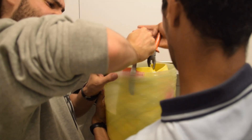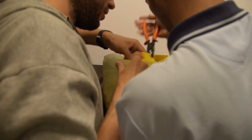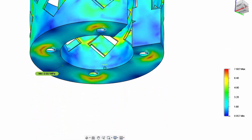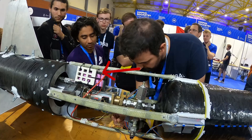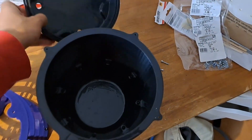Now you may have noticed that I never actually discussed a situation where you'd actually use a plastic 3D printed part as a structural item of the vehicle. Naturally, plastic 3D printing is not exactly the strongest stuff, so usually it should be avoided when dealing with structural items that are experiencing loads on your vehicle. That being said, if you've done your structural analysis and you've put in the properties for what you expect out of your plastic 3D printing and it's able to handle the loads, by all means go ahead and use it. Oftentimes you'll see PLA structures on a rocket that aren't experiencing so many loads, like potentially holding avionics components or other things like this.